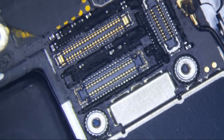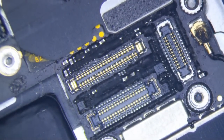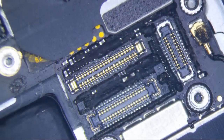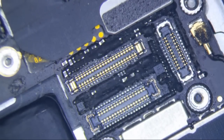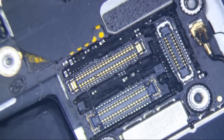The Meson chip is on the board. Constant power, short to pin, boom, pop of smoke. That's why it blows. So with the 6S and 6S Plus, make sure you disconnect the battery before you start doing any kind of screen repair. You have to do it. Otherwise things will blow, even if the screen is off.